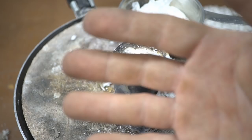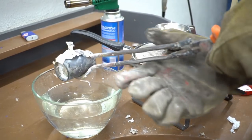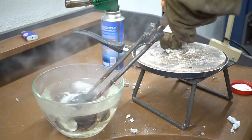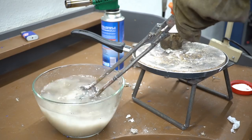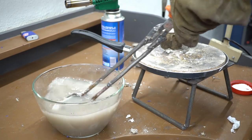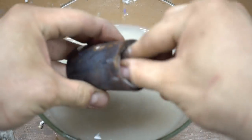I was worried and, for good reason, judging by the amount of metal in the funnel, the experiment failed. The mixture, while I've been practicing, never got to be an earthy color. Apparently it was quite raw and it didn't let the metal spill over. The moisture from the plaster began to evaporate sharply when the hot metal was poured.